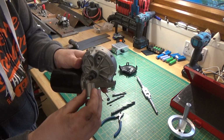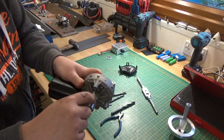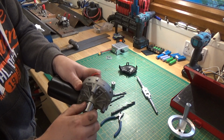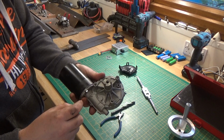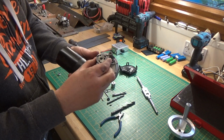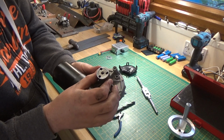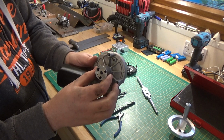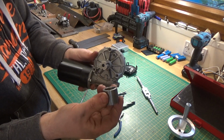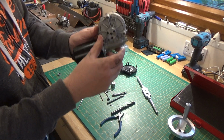That bit will screw onto there. And I'm going to put a roll pin, still a little bit of plug, probably tighten up a pinch more, and put a roll pin through there. That bit will sit over there, and I'm going to have a pin or dowel welded into there, so that can't spin on there.